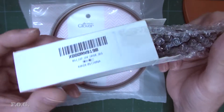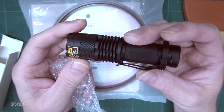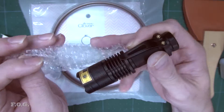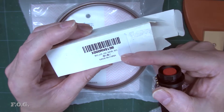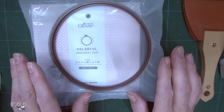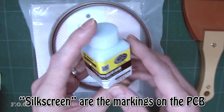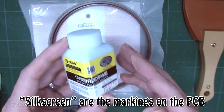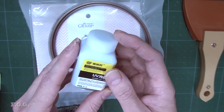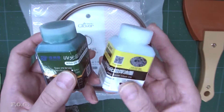I couldn't find good data on it. I also have this UV exposure LED lamp I bought a while ago — it says 365 on it, so maybe 365 nanometres — but this thing is absolutely useless, I could never get it to really harden anything. Anyway, I bought a big chunk of white UV resin, which could be good for the silk screening work but might also be good for making white PCBs — for example in LED light systems where you want a reflective surface.